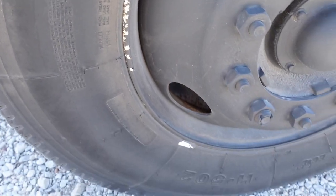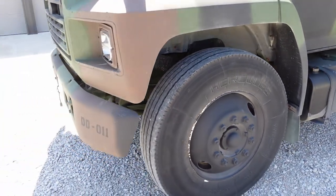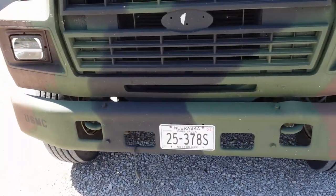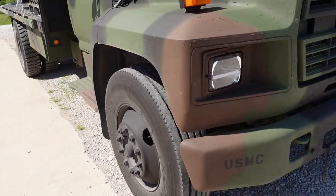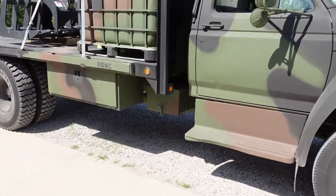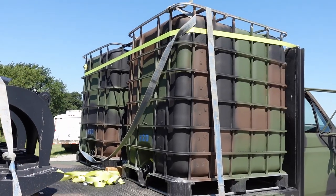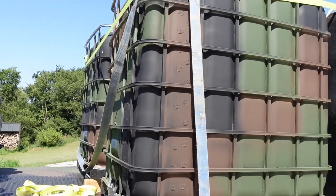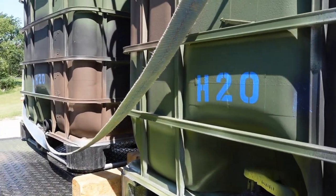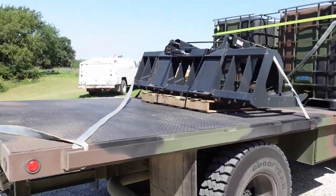Here's a great example of where latex doesn't hold up well — dirty wheels. I'll probably end up reshooting that one with Rust-Oleum eventually. A nice thing about Rust-Oleum is you can shoot it out of a can, though the downside is you can't add any dulling agents to aerosol cans. Whereas if you spray it out of an HVLP gun you can add something to dull the paint. This truck was done 100% with the HVLP — I even did these IBC totes, since they get brittle and crack in sunlight. Super quick and simple with the HVLP gun; then come back and stencil them. It's pretty fun playing with the stencils.